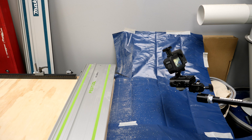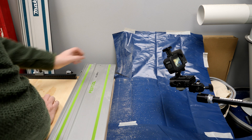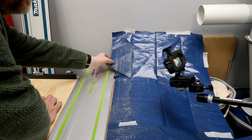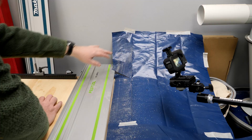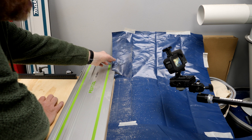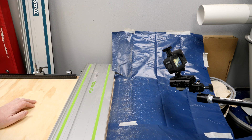Okay, so this is the test without the hole covered. You can see there's quite a lot of dust all along the length of the cut. There's particularly a large amount of dust that's been ejected in front of the blade forward. I've caught some of it — it's kind of stuck to the plastic here, some of it's fallen down the back. But overall, compared to no dust extraction at all, that's not too bad and I would have been quite happy with that. So let's clear this up and start again with a clean setup, and we'll do it with the dust cover on.